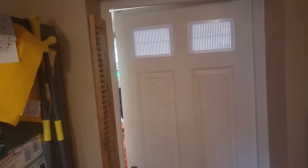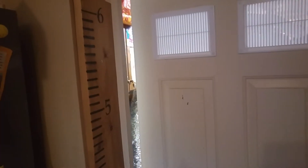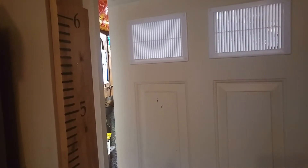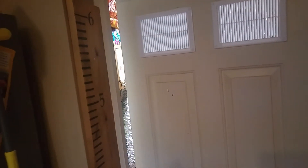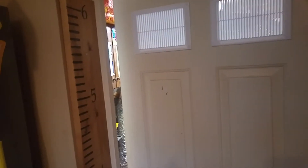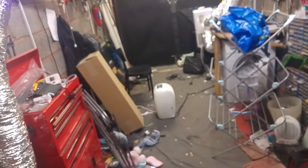I had planned to put grills in all the doors, but I found that it restricted the return flow and that some of the air was short-cutting through leaks in the house and pulling cold air in. So I've abandoned the grills and just keep the doors open. On this one I've added a spring to keep that gap to allow the return flow to the heat pump.